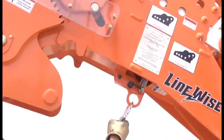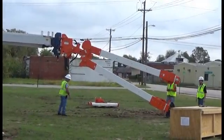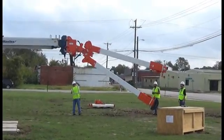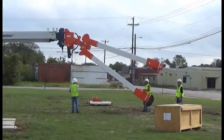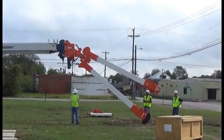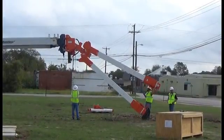This is a close-up of the arm locking bar and the lever used to unlock the arms. The phase lifter is deployed by having the arm with the sled attached resting on the ground and pulling the pin that holds the arms together. The latest version of the phase lifter has done away with the half-open lock position, so the man holding the rope at the base of the phase lifter is no longer needed for deployment.